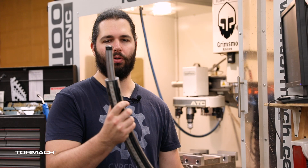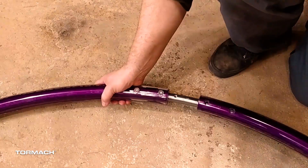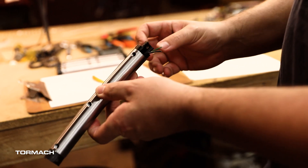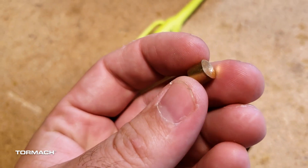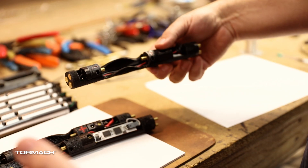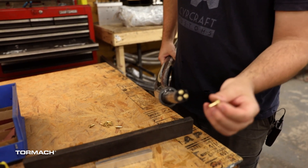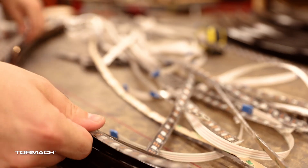This is a section of one of the LED wheels. Each wheel goes together in five sections, and each section has one of these coupler inserts that bolt into the next section. We need these electrical contacts to be held on to the end of the section, and then they mate with spring pin contacts that are up inside. We use the CNC to make this housing or holder for the contact pads, and we also CNC the ends of the inserts with the holes in precise position so that we can attach this to it.